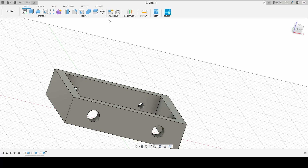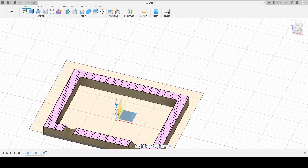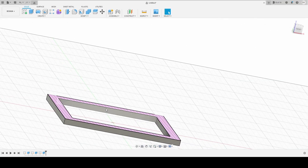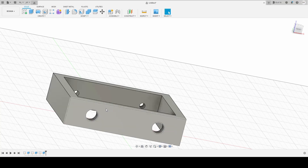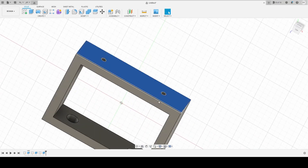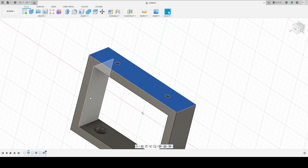Normally what I would do is make a section and print about that much of the model to verify my geometry — make sure it fits within the size of the place that I want it. But in this case, because I actually need to check that my screw holes work correctly and aren't too small and don't split, I need to print the whole thing. I'm not really sure about these big holes — they'll probably be fine. My plan is to mount this surface along the bottom of my desk with two screw holes in it.